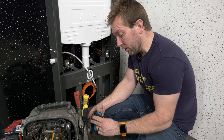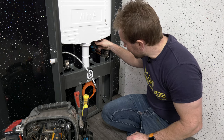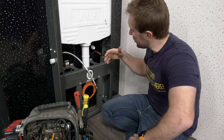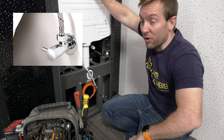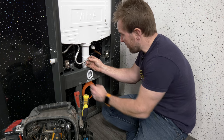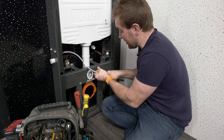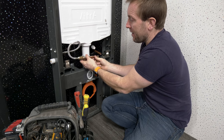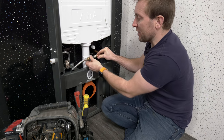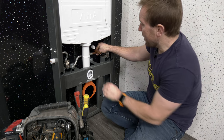So for this video, we're not using the hot. Just for the purposes of this video, we're just gonna cut the hot off and leave that plugged back out of the way. In Europe, you'd usually find a special little valve sticking out the wall with a little flange on it, but we don't really tend to do that as much in the UK. So what we're gonna do is just pop a valve on — we need to make sure it doesn't kink. There is a little trick you can do for these that stops them from kinking: if you go round like that, that won't kink, that'll never kink. It's when you start trying to bend something in a way that just doesn't like it. Great pipework and serviceability — those are the two things every plumber should be thinking about.